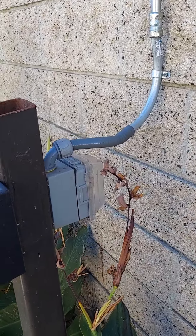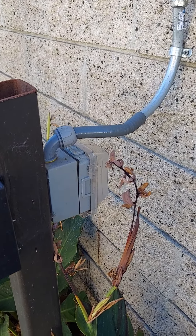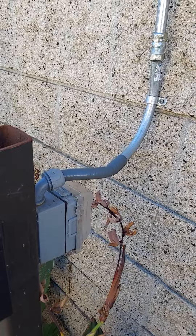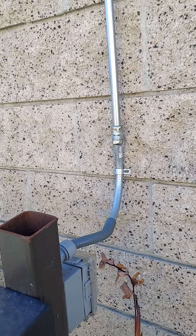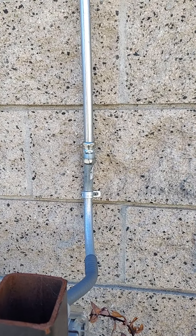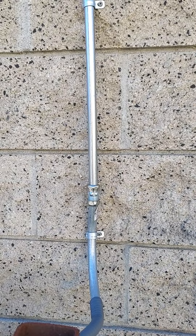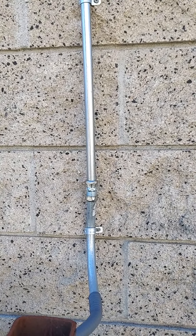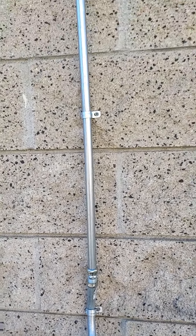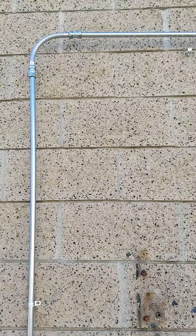Check it out — you have a 90-degree liquid-tight connector with what looks like half-inch liquid-tight going to it. There's no flex-to-EMT adapter or coupling at all, going to a one-hole strap without the proper type of screw, which should be a tap-con or at least an anchor that supports the weight. Then it goes to a compression fitting — not a rain-tight fitting, which is what that should be. Rain-tight fittings are blue with a yellow piece of rubber inside to seal the opening so rain can't get into it.